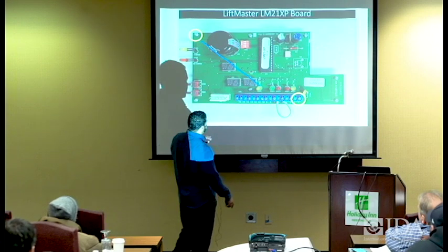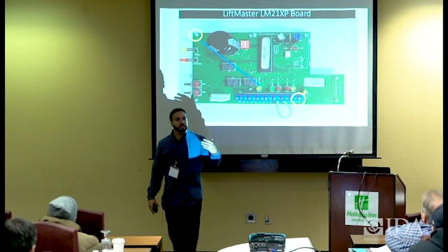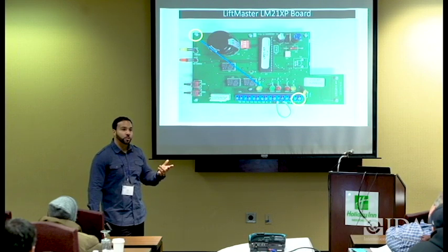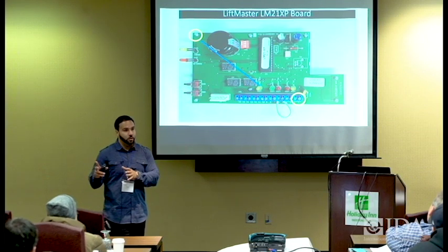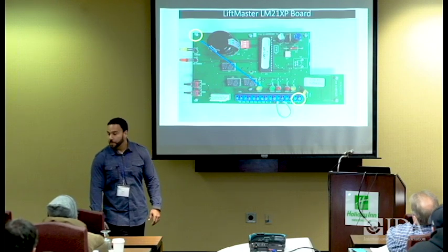It's a lot of terminals here for you, and these are monitoring terminals. They will let you know the position of the door. It would also give feedback to the actual fire control panel, if it's an alarm, an alert, or a fault. So it's self-diagnostic. It will work in conjunction with the central building alarm system to let them know if something is wrong, a trouble signal from the unit.